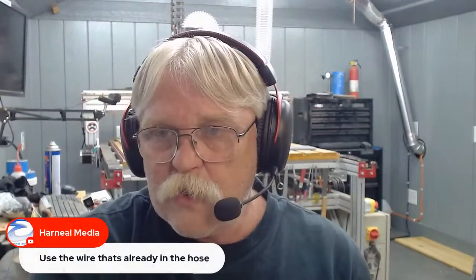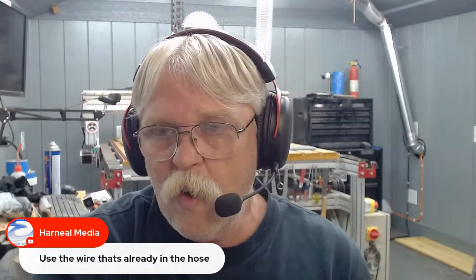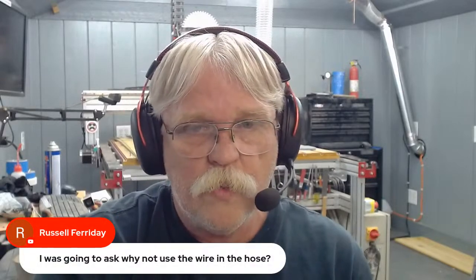So a couple of people asking, Steve says, use the wire that's already in the hose. Russell says, why not use the wire in the hose? One simple reason: that's not metal wire, it's plastic. So there's nothing conductive in that hose. So I'll go with braided copper. And it's not expensive. I just don't have enough on hand. I had some, can't find it. Don't know where it went. So I got to go get more braided copper.